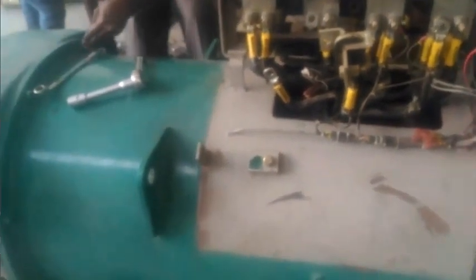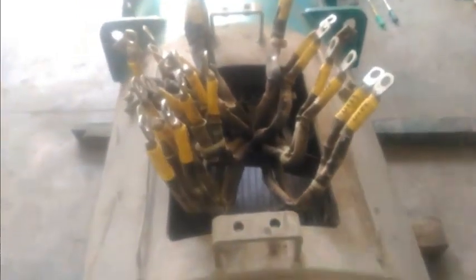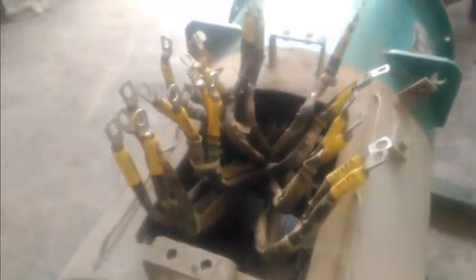This work is exactly after two weeks of the other one that we did. Very exciting work going on right now. The motor is dismantled. Here are all the lugs on the tables, all the 24 leads of the winding outside. We're done with the recording of the terminal placings. Now we see the state of the stator. It's burnt — it's blown up for a bad reason.